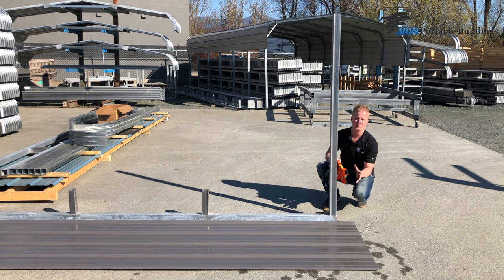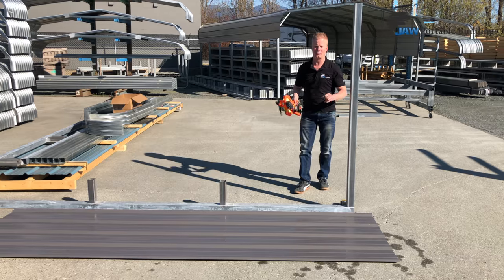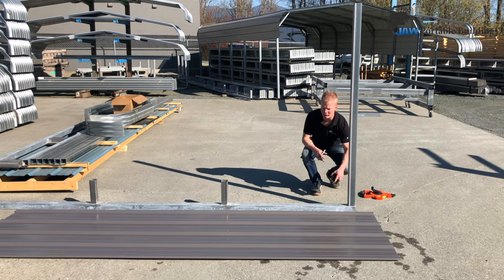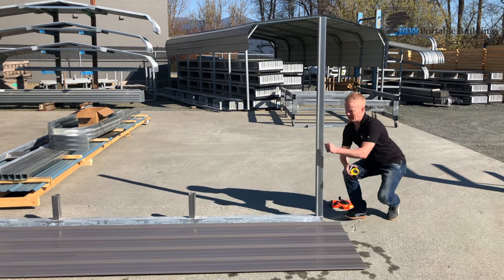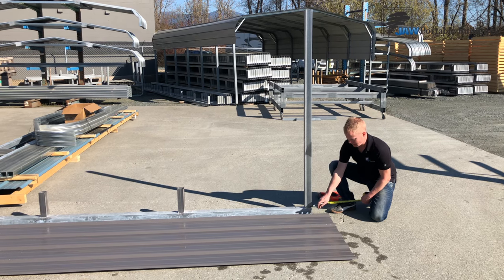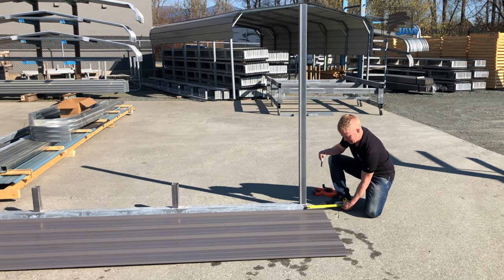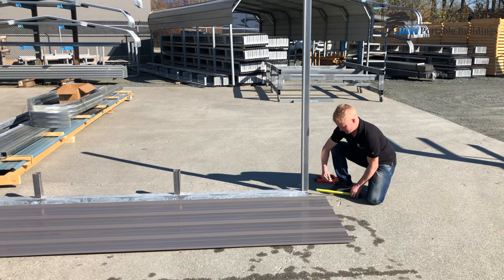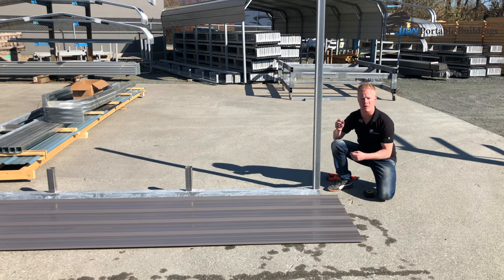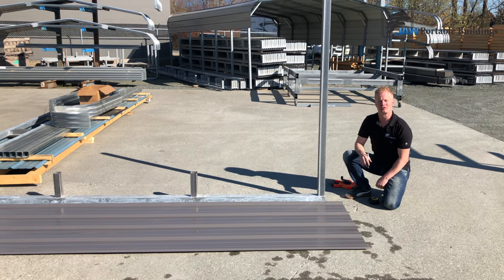Then you want to get the location of your building exactly where you want it. Grab a long tape and corner-square your building — this is very important to keep all the sheeting 100% square. Once you've done that, grab your very first sheet and lay it down beside your base rail. The trick to avoid transferring measurements twice: if the base rail is 20 feet long and your sheet is 21 feet, hold the tape six inches over and mark the sheet on every stud the whole way down. When you bring the sheet up on top, this stops your legs from going out of parallel and keeps everything strong and square.